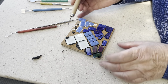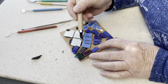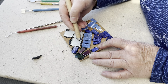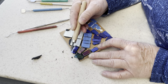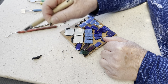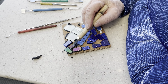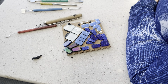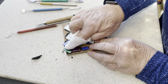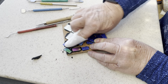The cutting tool here is great if you end up with some glue edging your tile that you want to get rid of. You can scrape it off with this little tool because it fits right in and does a really good job — you can see how it's taken off that really thin bit of annoying glue that you don't want to interfere with your grouting process. Then there are little bits and pieces on top you can just scrape off. Use some nice sharp baby wipes, which are great for your hands and great for silicon, and just rub it off. Make sure you've got everything off — it makes it all nice and clean so you can see where you're going, and there's plenty of room for the grout.